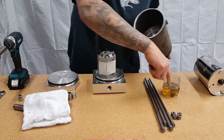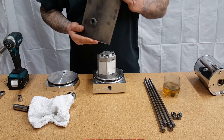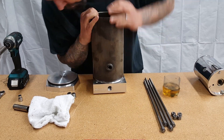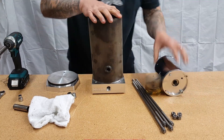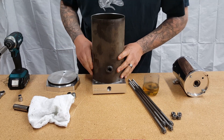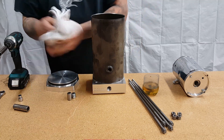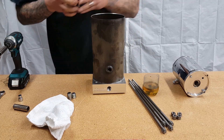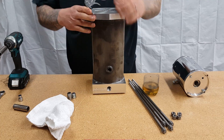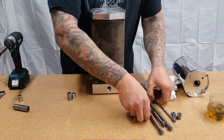One thing that's going to be slightly different from a piston pump to a regular pump is your tank fill or oil fill is going to be in a different position. The position is actually going to go closest to the block — the tank port itself is moving from the back side, where it's normally at, closer to the block. The reason for that is there can't be any obstructions when the piston is traveling from back to front, and the oil is going to be on the front side of the piston. We always pre-lube all the o-rings to make life easier so it doesn't chew them up. He lubed up the o-ring, put it on track exactly where it's supposed to go on the tank, and then pressed down firmly.